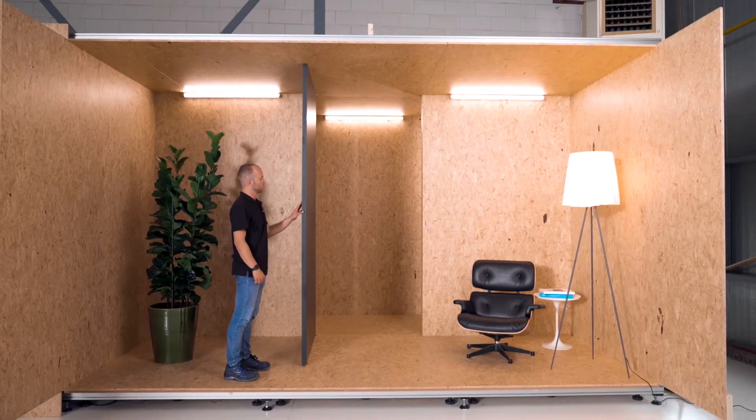Today we're installing a System M32 Plus and the top pivot 17mm in this door. System M32 Plus is suitable for side placement only. Our pivot point is located at 70mm from the side of the door — the maximum pivot point closest to the door for the top pivot 17mm. This door is 2.6 meters tall, 1.2 meters wide and weighs about 80 kilograms.